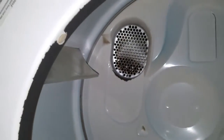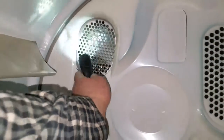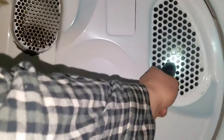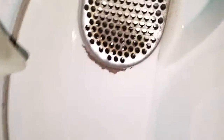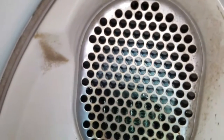Nothing's changed on the inside. If you look in here, it's nice and warm. Normally your hot air comes in here and the fan sucks it back out. That's all we're doing — the air is just being sucked through the hot water coil on the back side instead of the electric heating element.